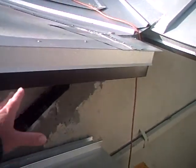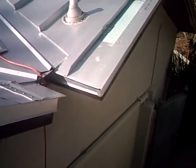Here's a detail I had to overcome — the original roof extended down here and was terrible design, just rotted and everything. So I ended up cutting it back and re-sticking in some areas. You can see I haven't put that sidewall in yet. There's my vented stove hood I put in last month — really happy with that. I wanted to get the kitchen vented completely and didn't have to penetrate the wall with a side vent.